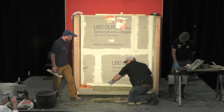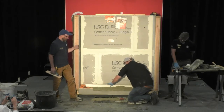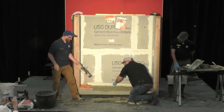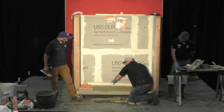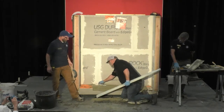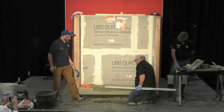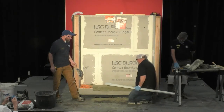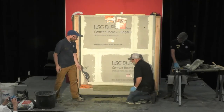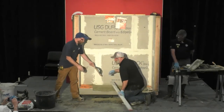We won't be able to go quite to the edge — we'll just cut it off right about here so you can see. What I want to do is bring my straight edge in a couple inches off the wall and work it over to the wall. Once I get enough of a place to use my trowel, I can just bring it over and cut it off square and get rid of that excess. But as you're going along, you always want to put your straight edge on there and kind of check and see how you're doing.